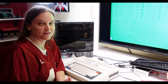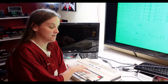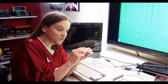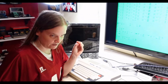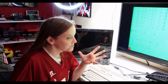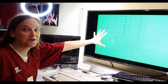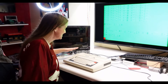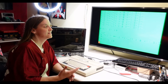The plan today is to upgrade this computer to 64K and hope it still works. There is a nonzero chance that we take the chips out that add up to 16K, put in the new chips that add up to 64K, solder the one little joint that needs to be connected to let it know it has more memory, turn it on, and have broken everything. Depending on how well the de-socketing of the original chips goes, we could break them along the way. That's why I wanted to show you it's working before we touch it.